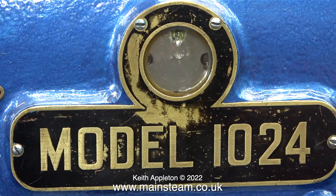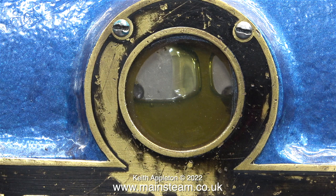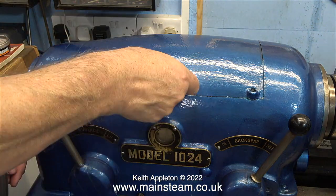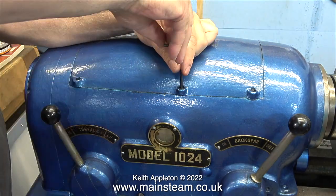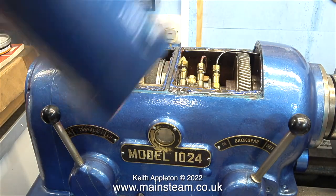This oil is quite new but it's not the right stuff — it's a bit thick. Here's a flashback showing what the lubricating oil looked like. Because this oil is really good quality, I thought it would be okay, but it's too thick and the viscosity caused me some problems. The first problem being it took a while for the spindle to reach maximum speed, and even when the lathe wasn't running the spindle would rotate just with the drag of the oil in the primary gearbox.